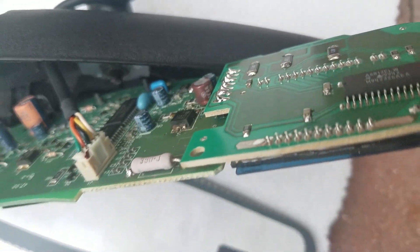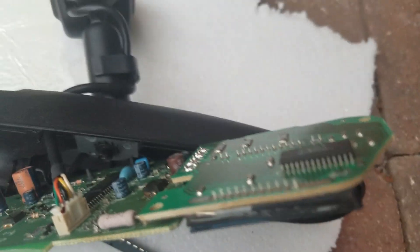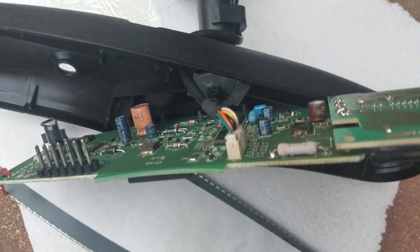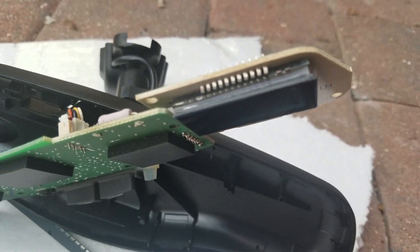So that's how you fix it — try all those, try all those big resistors and the other little resistors, and check them all out. That's on that daughter board over here — any connection on that daughter board. You could also go over here and look, but I don't think that was an issue. The green light lit up and everything, but this thing would only work when it wanted to. Very annoying.